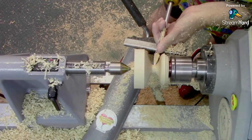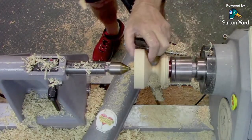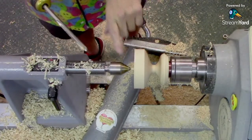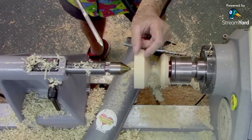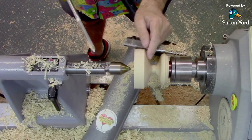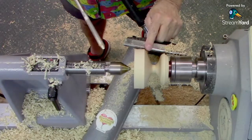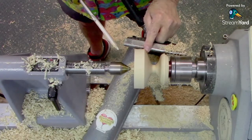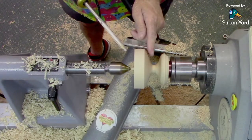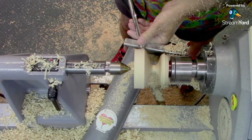Does that curve to the outside match the bowl that you've got on the end? No, it needs to go deeper yet than here, when I've finished the inside yet. But is this not too thick? No, not yet, because you're going to dish it some more, so you're going to need some width to dish the outside, the bottom bit. This bit. Yeah. So you're going to have to come up that flat and then start to curve it from there a bit.